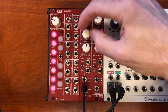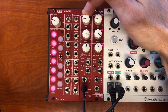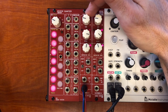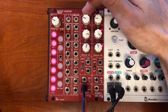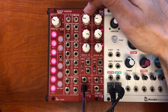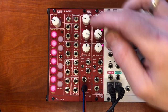Only after some time I realized you need to find a sweet spot based on the combination of offset and gain where it will work. I've had good experiences with turning the offset all the way up, relaxing the muscle — don't do anything — and then turning the gain down until you see the top pair of LEDs change. See? Now it changes from left to right. That's the sweet spot you need to find where it does this without you doing anything. Once you find it, set it just ever so slightly so it's not blinking to the right one. And now if you flex the muscle — which is what I'm doing now — you should be getting a signal. Because I'm not smoothing the signal with the switch in the center position, it's the raw signal, so you can see it flickering a little bit.